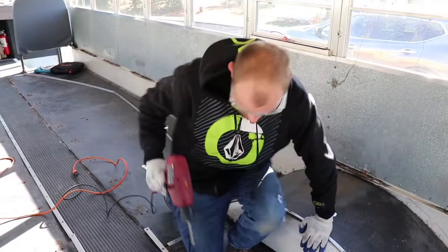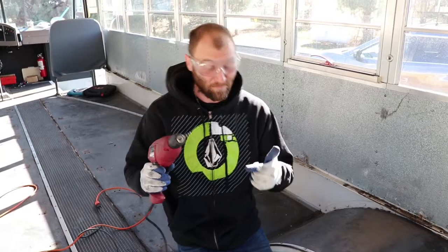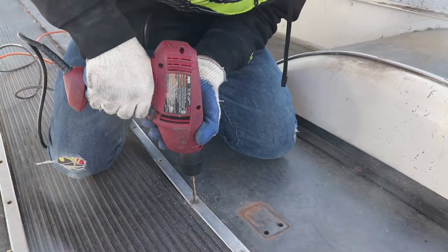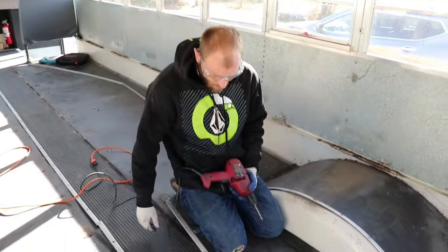We didn't have to get new drill bits, but they're really hard, so hopefully I will not break this bit, because when it's hard, it's brittle. Get it down in there nice and straight. Slow and steady and straight. You can see it's smoking kind of — slower speeds are better. Pop!